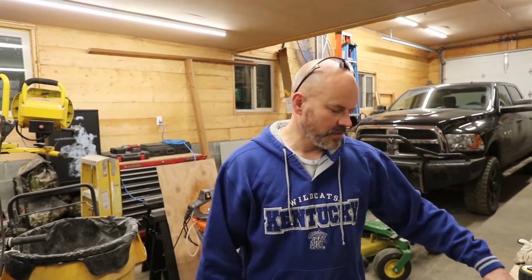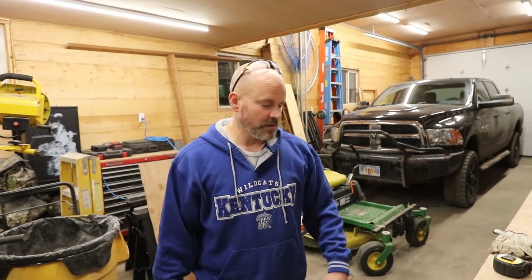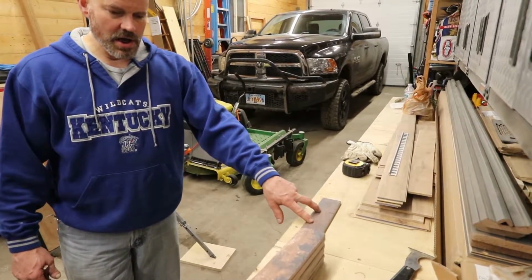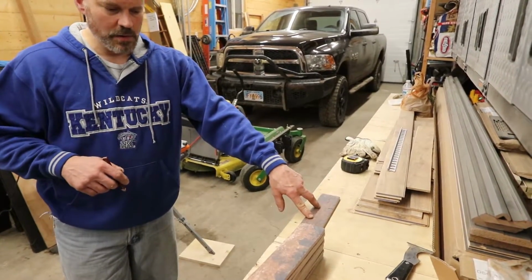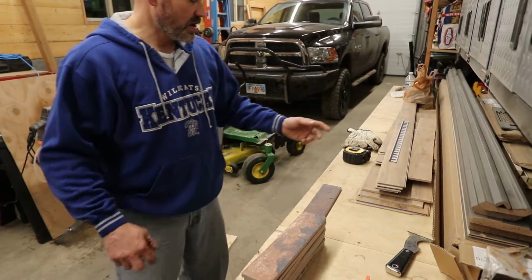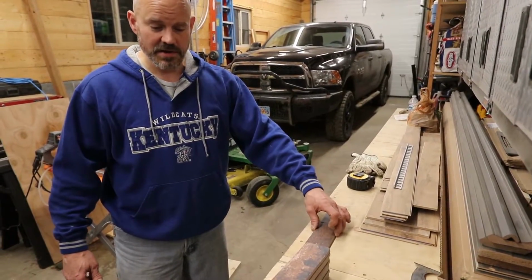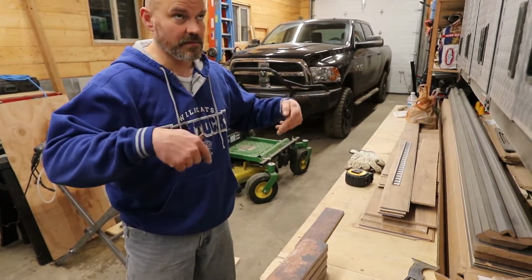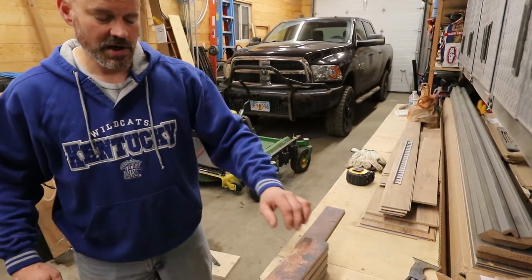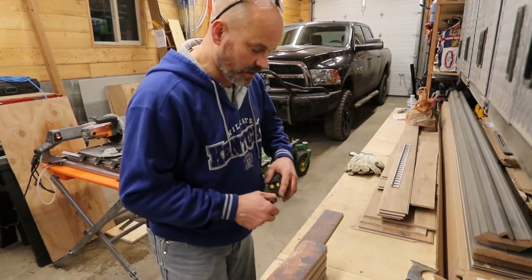Now I have certain bricks, or clay tiles, that I will need to be cutting. The ones across the front I'm cutting at 3.5 inches off each end of the brick, and the ones down the side I will just cut in half to finish out that template, because with the way we laid it out, we're going to have minimum cuts. The ones across the front I had to cut, and every other one down the side had to be cut at 4.5, and that will be all the cuts we will have. Everything else will be laid out.